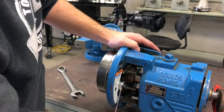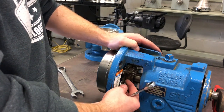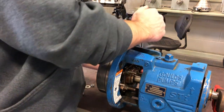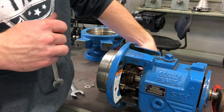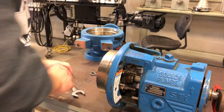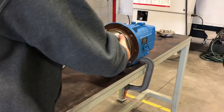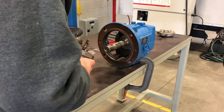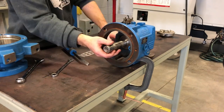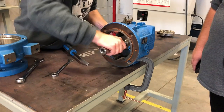Now I want to show you that we're going to remove those two back nuts that are located on those studs — that should be all that's really holding that back plate on there. You do need to reach in with an Allen hex head wrench and loosen up the part of that mechanical seal. Next I go ahead and slide off that back panel and set it off to the side. There's also a sleeve in there that you're going to go ahead and remove. You can see in this video that it doesn't want to come off at all — that's how beat up this shaft is right now, which is why we're putting all new stuff in.